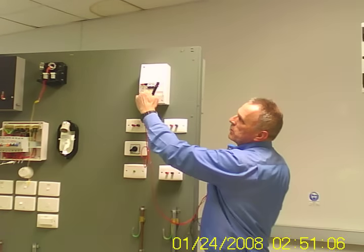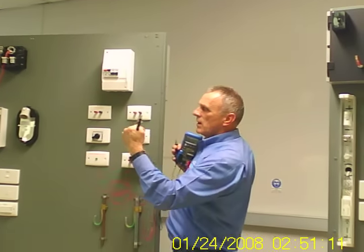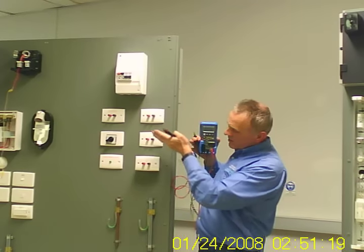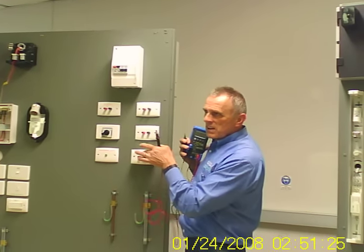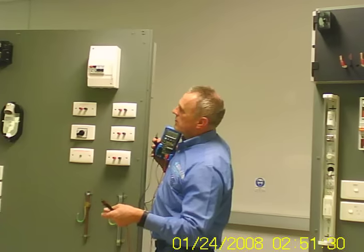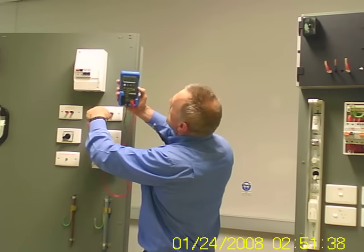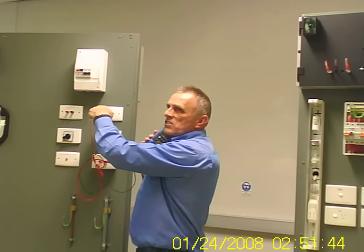Okay? And as you put more load on, you reduce the resistance and then affect the current, and because current is proportional to voltage, your voltages will proportionally be altered between the appliances and your earthing system. So if I have 150 volts here, the rest of the voltage will reflect on your earthing system, 80 volts. Let's just see here, with one circuit in, and the high resistance, we've got 21 volts there. Already we've gone from 27 to 21.